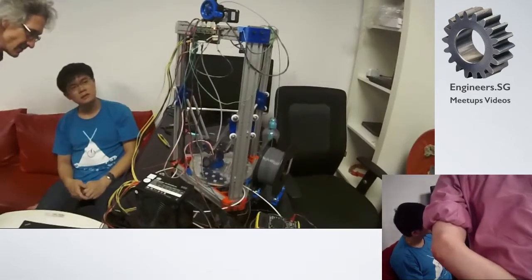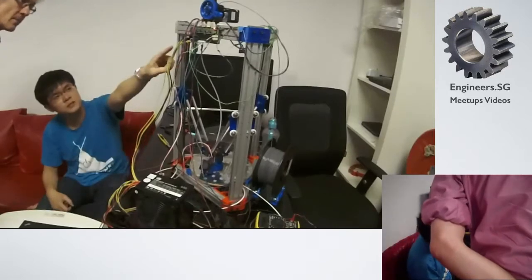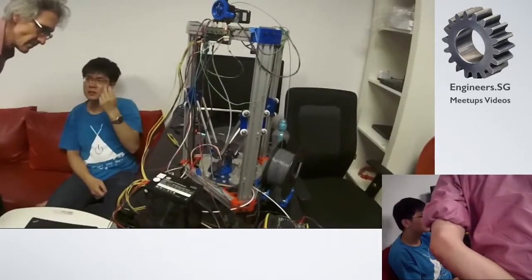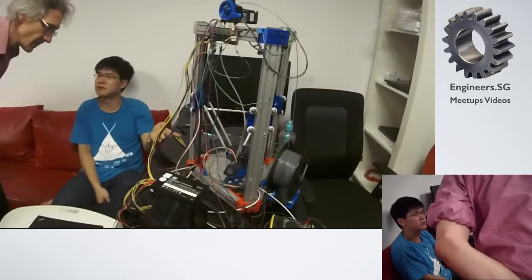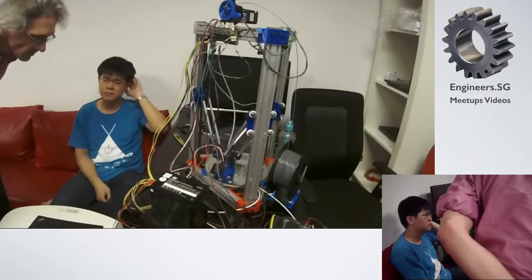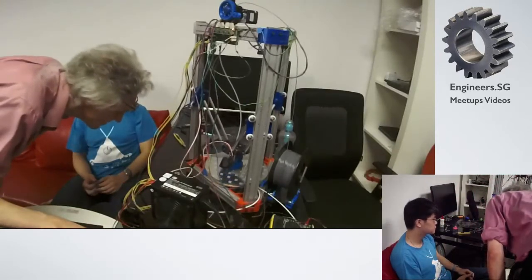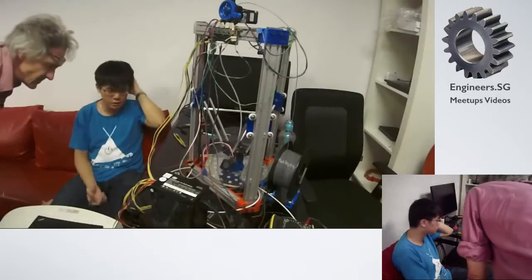The Sanguino actually has terminals for the heated bed. There's a spot there to control the heated bed, but the traces on the PCB are not thick enough for the kind of current that this bed requires. So that's why I have this external relay. It's a solid state relay, on off.